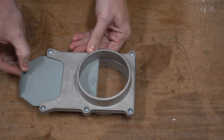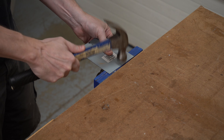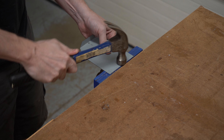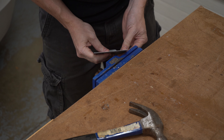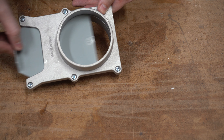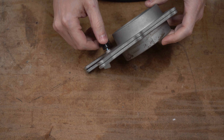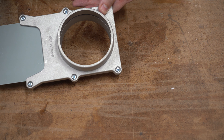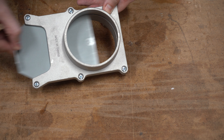The next step is to allow the gate to fully open. This is extremely simple — we just need to remove the indent in the gate with a hammer and then throw it in the vise to ensure that it's flat. We won't need to raise the gate to one side anymore because the plastic is already doing that. The only downside is that you can actually pull the gate out now, which won't be an issue for me once I finish my full automation project, but for those that don't go that route, you can still use the thumb screw to keep it from falling out. By doing this, the gate opens all the way and no more limiting the airflow. It also allows the piece to go even further in, which ensures no dust will get stuck in there at all.